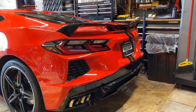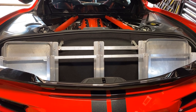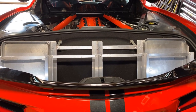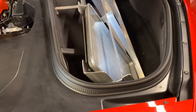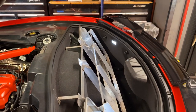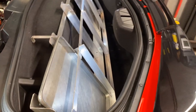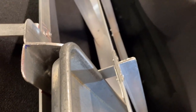Now I'm going to open up the back and show you how it looks. Today I decided on the second tier to use one inch angle aluminum, and I used a three quarter inch piece of aluminum for the structure to hold the second tier. I basically bent the aluminum bar three inches on both sides so that there'd be something for the angle iron to sit on. I had to put two braces in between to hold it at the right level at two and three quarters inches.